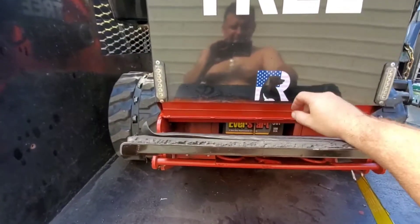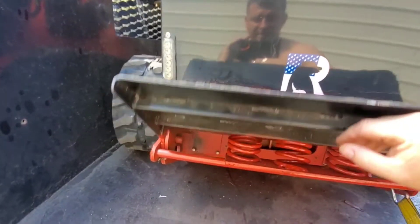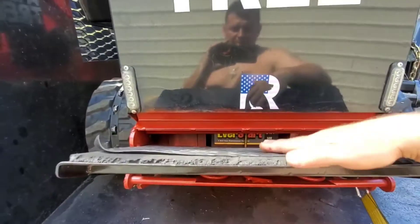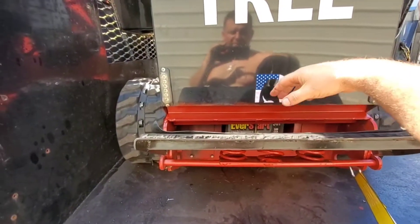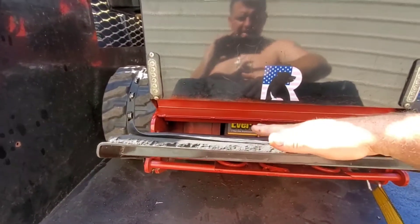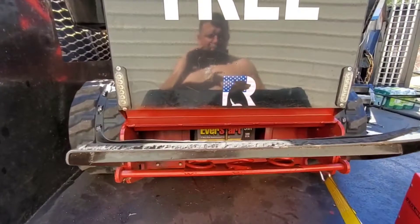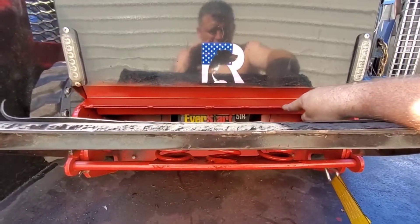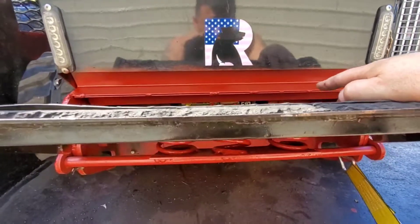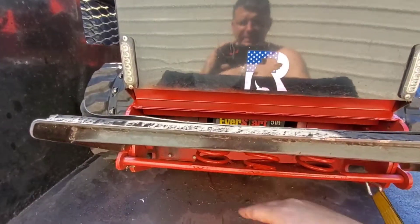I think this is going to solve my issue where my feet are not cooking. What I did here is I took off about two inches all the way across the front of this pad, so the hot air flows right through it and doesn't bounce off onto my feet. The metal stand was blocking the hot airflow from passing down. I cut that a bit, found some angle iron laying around, got two pieces, welded them together all the way across — put a tiny weld on both sides — and that roughly gave me about four inches.